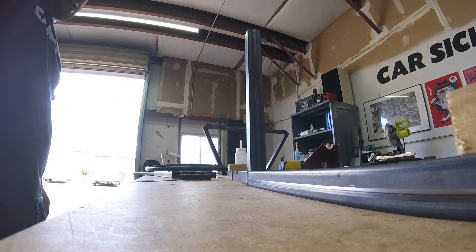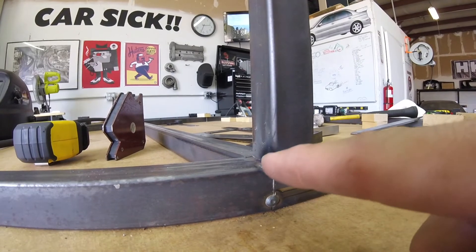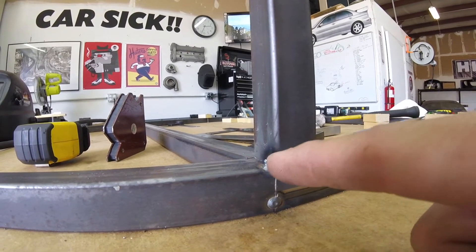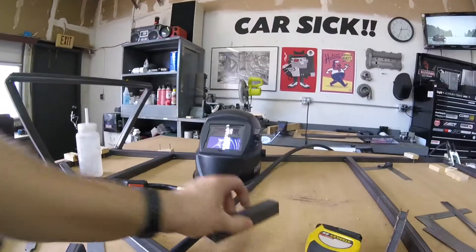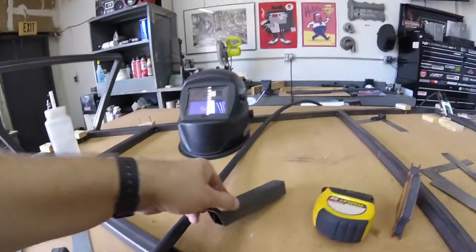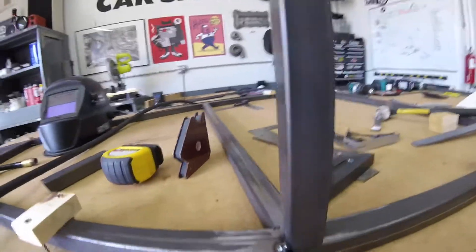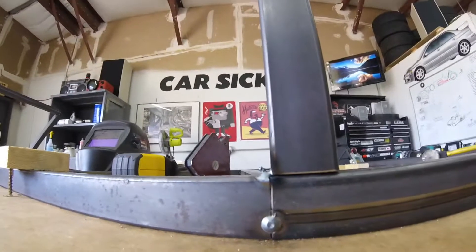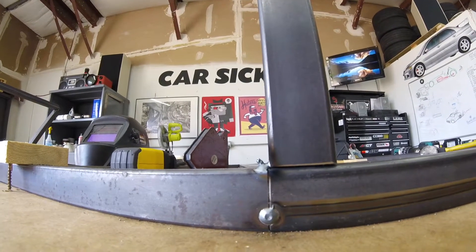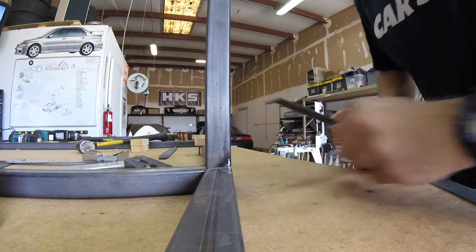We have a vertical tube, baby! Your very first weld — don't do it on the car because there's no gas in the line and it leaves a little booger on there, doesn't have good gas coverage. I keep forgetting to do that. So first turn the welder on, run a bead or a tack on some scrap first — that way it purges the line and gets your gas all up in there, because the very first weld always looks like that. Very first tack — it's so ugly. It's like a little metal pimple.